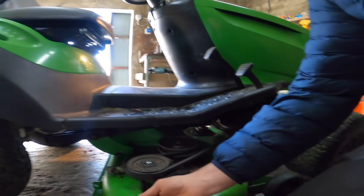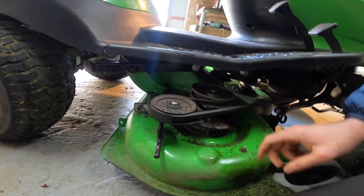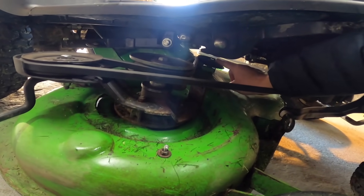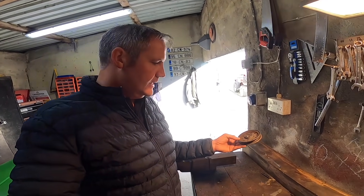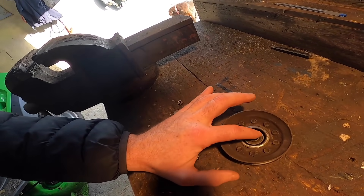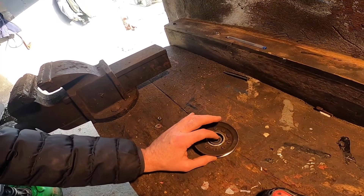If you go to the far side, this little fella here is a belt tensioner. If you pull it back, it takes the tension off the belt so it allows you to lift the belt off quite easily. But there's one in here in the middle — I'll show you what condition it was in. That's the tension pulley — it's not actually driving any of the blades but it's more of a tension pulley. Basically the bearing had fallen out of it. The metal plate was around that bearing but there should be a bearing housing around that. It was just wobbling around — I don't know how it managed to stay together. It was actually sparks flying out of it, so it was definitely something that wasn't going to last much longer.